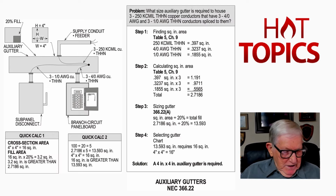We will look at 310.15(E) on the left-hand side of page 160 with the title head Neutral Conductor, and we want to focus on (E)(3), and it basically reads, on a 4-wire, 3-phase Y circuit where the major portion of the load consists of nonlinear loads, harmonic currents are present in the neutral conductor. The neutral conductor shall therefore be considered a current carrying conductor.